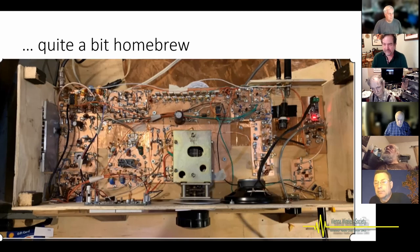One thing I'd advise is, if you're going to do the VXO, get the crystal as high as possible in frequency. I started out with this rig with the crystals at 12 megahertz. I couldn't move them that much. So then I went up and used 23 megahertz. I could move them a lot more. Of course, you got into the sideband inversion problem in one way or another, but that was a different story.